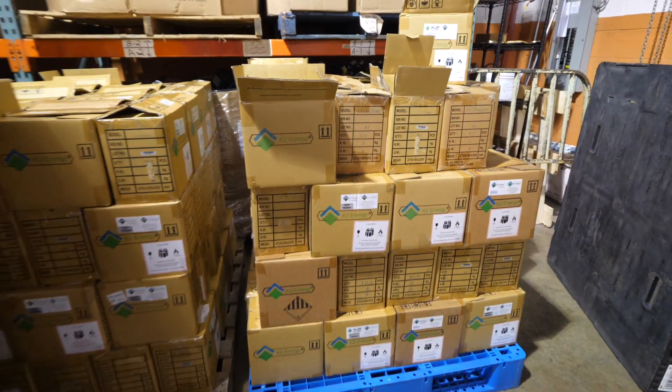The answer is lithium iron phosphate. This lithium chemistry has a 3.2-volt nominal voltage, so using four of them perfectly matches the 12 volts that come out of six lead-acid cells, meaning they're compatible with all 12-volt legacy equipment. The only problem is that lithium iron phosphate is not as popular as lithium cobalt oxide, so they're kind of hard to get and expensive — well, that is until now.